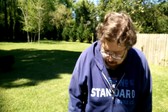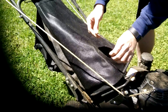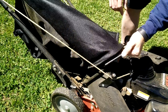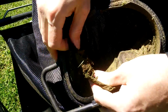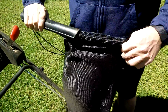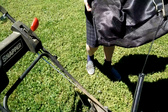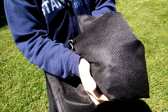The other big design issue — and this is what makes this mower pretty much unusable — grass comes up the tube and it hits right on the top of the bag. You can even see when it's running that there's a little mound right here. It has a liner inside, and from the grass hitting it, a hole generates in the liner. I have a big pillow full of grass clippings that are not in the bag — they're between the liner and the bag. So there's nothing actually in the bag.